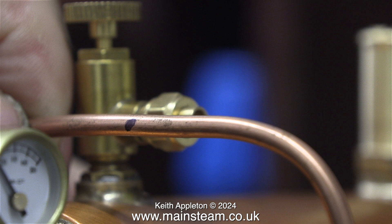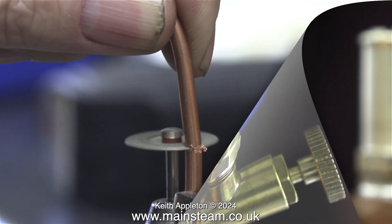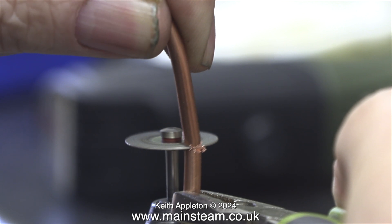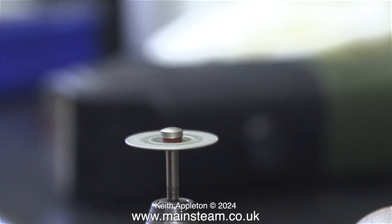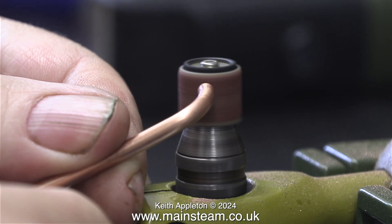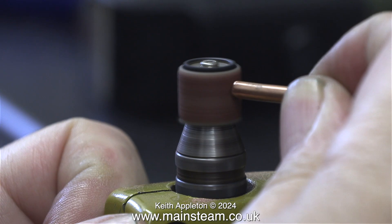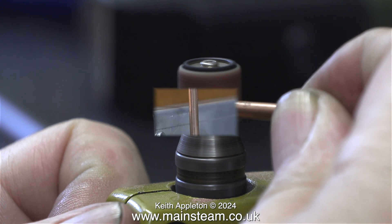A quick look at the steam tap — this is fitted with an adapter union. Normally a steam tap of this size is suitable for 3/16 pipe, but with an adapter union you can use 4mm or 5/32 pipe. This small diamond cutter in the Proxxon mini drill cuts the pipe very quickly. The only problem is that the pipe gets quite hot, so I'm holding it at the bottom using a pair of pliers. To deburr the pipe I would normally use a 1-inch belt sander, but instead in this workshop I'm using a drum sander, which makes short work of the burrs, cleans up the end, and the parts are ready to be silver soldered.